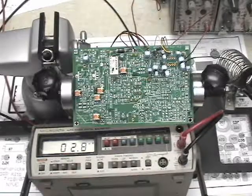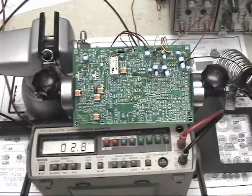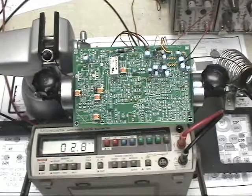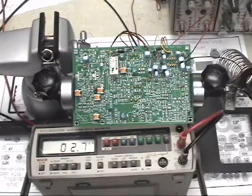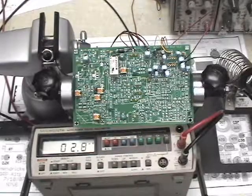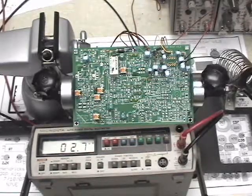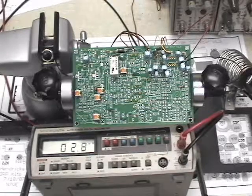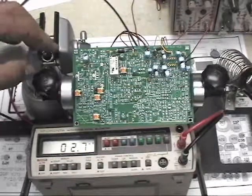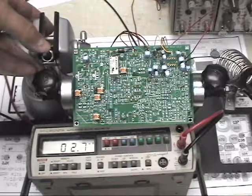We need to subtract 2.8 milliamps from any readings we get until we reach the place where that section is also installed per the procedure. The step says we should have 0 milliamps because there's nothing at this point that draws current, but the bias network on the two transistors and the transistors themselves are pulling current in the audio output section. When we switch to transmit, he calls for 33 milliamps, so we'll need to subtract 2.8 from it — we'll flip the switch and hopefully no smoke results.